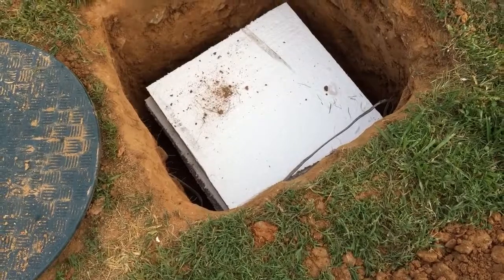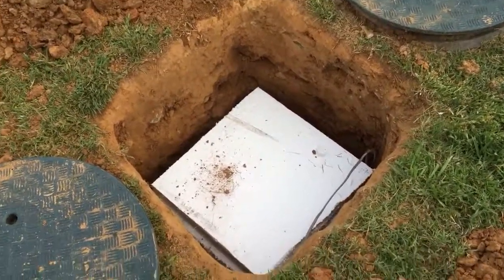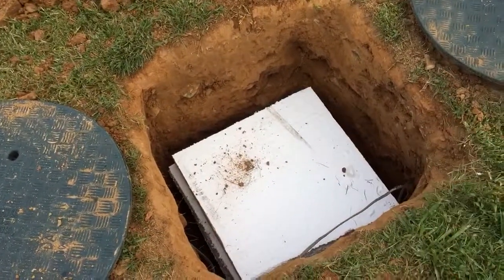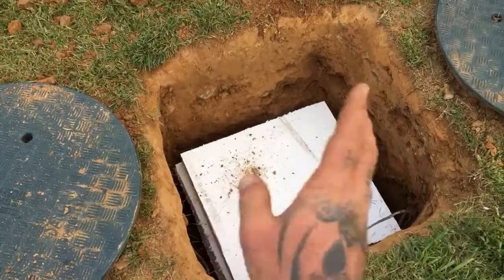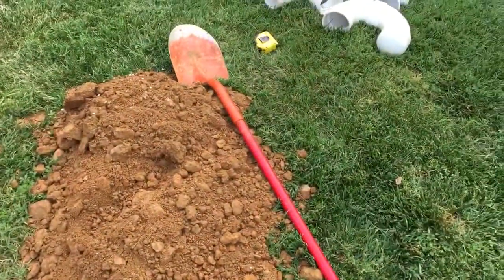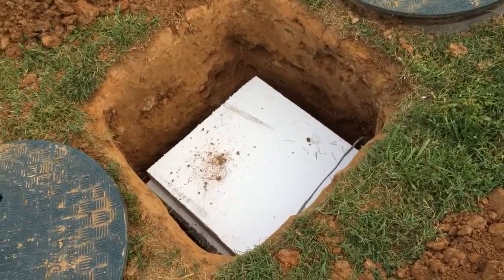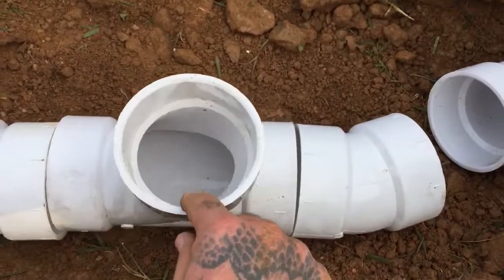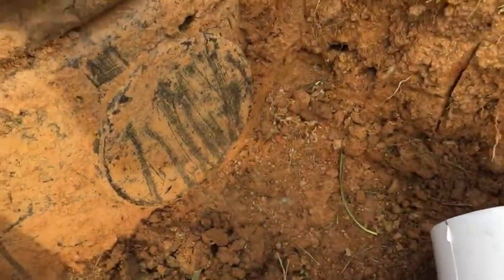I got about 16 inches of styrofoam, so a big slug of dirt like that probably takes about 300 pounds or more off the top of my tank — not including the space the fittings and pipe will take up. Connecting from this riser to this riser will allow air to pass through the tank, help airflow in and out, and let fumes vent. If I happen to get a smell, they make charcoal filters for about 60 bucks that plug right onto the pipe sticking up out of the ground to kill any odors.